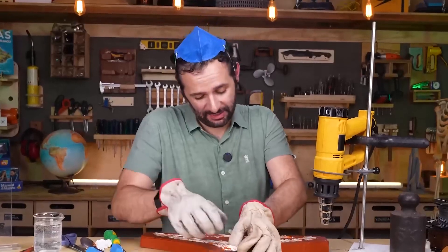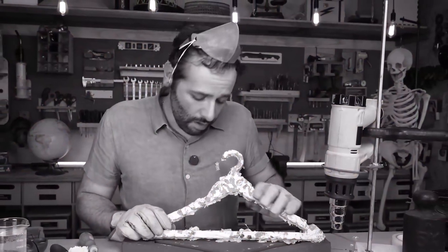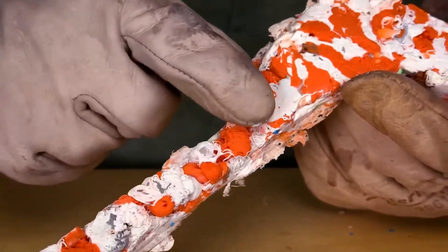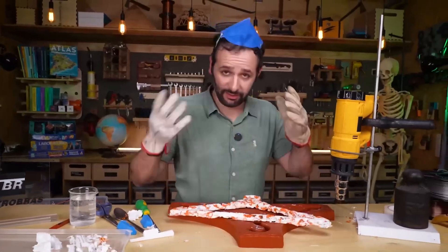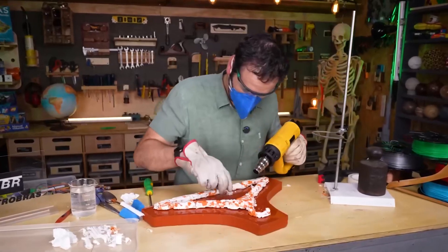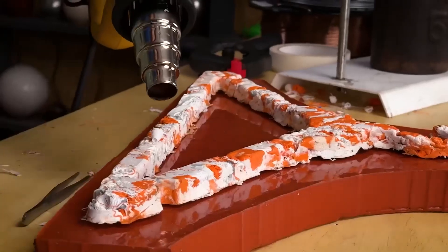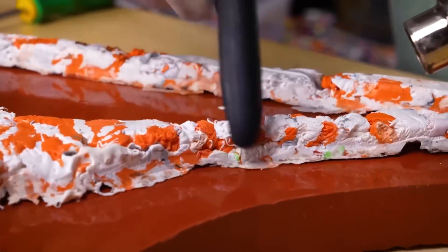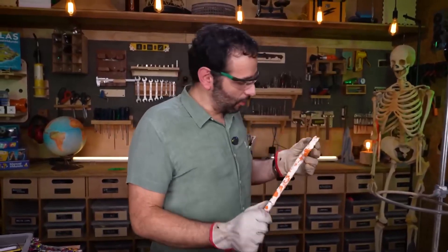It needs about 15 minutes to cool before you can remove it from the mold. The first attempt came out kind of holey — where I melted the PLA thoroughly, it turned out great; in the spots I didn't, it didn't. The first layer ended up full of holes. It still needs some finishing, like removing the burrs. I'm going to make fixes directly in the mold, upside down, because silicone handles heat better than my table. If it's your first time, heat the hanger, place plastic pieces on top, and they'll stick right away. The second hanger looks better but still has a lot of burrs that could snag and ruin clothes — let's remove them with a utility knife. Anything you take off can be melted and reused.